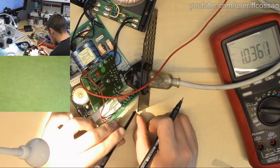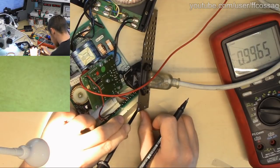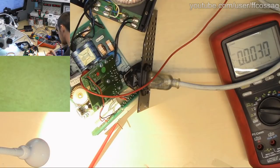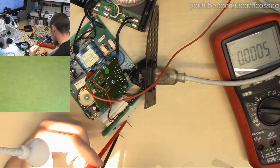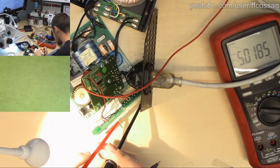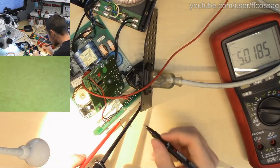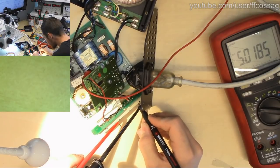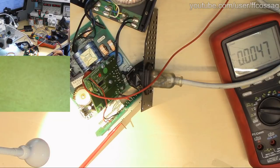There's something weird. More weirdness. Probably the other regulator board. Yeah, I think we're done. So we just have 3 grounds for all those 5-volt pins. Weird. Very, very weird. We don't have grounds on the other side. No. How odd. Oh, there's another ground. Another ground. And another ground. We would expect at least as many ground pins as we have 5-volt pins. We have 5 5-volt pins, and now we actually have 5 grounds. So if that makes sense, I think we've found most of it.